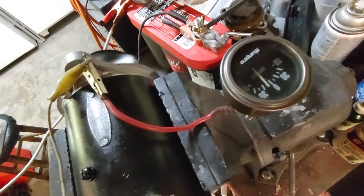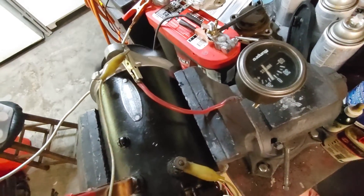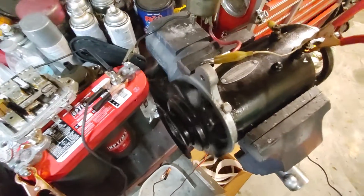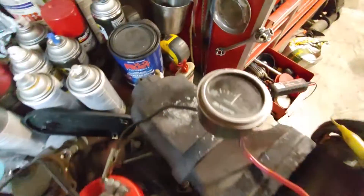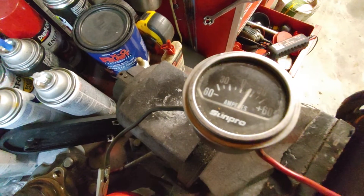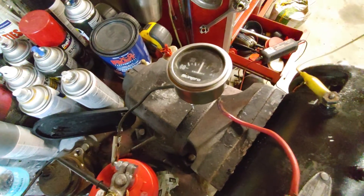When I take it away it speeds up just like it's supposed to and the vibration gets much faster, but like I said this does not work. It passes the motoring test on both sections, but it does not charge — trust me. So that right there is the giveaway. This growler should confirm I have a bad armature, and once I get the growler I'll make another video.